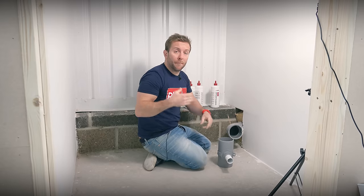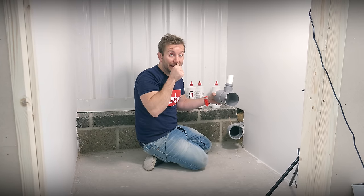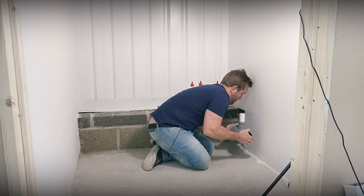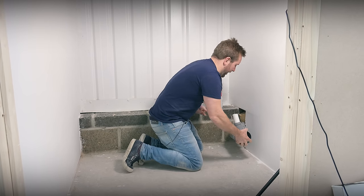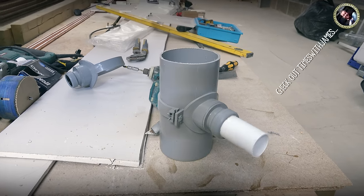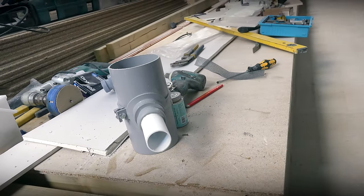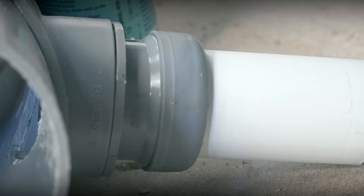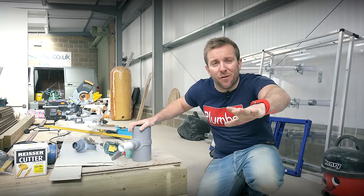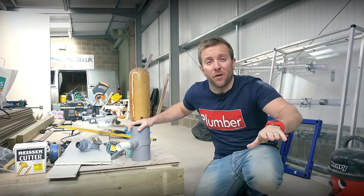Something you need to think about when doing this sort of work is make sure you've got the pipe angled up nicely, but not so much that it doesn't drain the toilet. If you start running water down into this, you don't want it filling back up into the toilet bowl — the last thing you want to see is something unpleasant turning back up. So we've now successfully bossed into this lovely bit of four-inch pipe. Please follow us on Instagram, Facebook, Snapchat, and Twitter. I hope to see you in the next video. Until then, hold that — see ya!